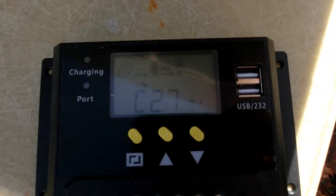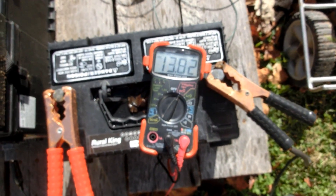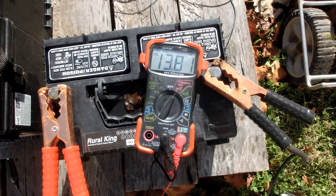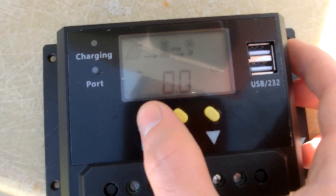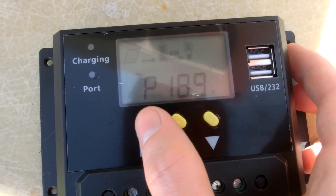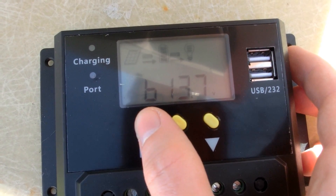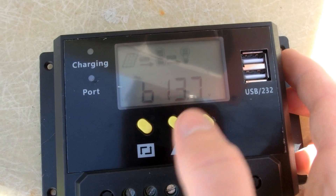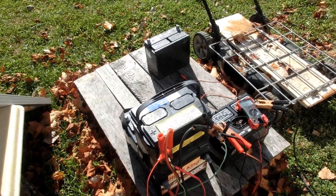This is slightly odd — it's still on the float setting, but it's only giving 2.8 amps. Just a minute ago it was still on the float setting giving almost 5 amps, and it was keeping the battery at 14.2 volts — a little bit higher than I'd wish — but now it's at 13.8. The panel voltage hasn't gone down: battery is at 13.7, panel is at 18.9. Perhaps it's supposed to keep it at this voltage. I'd rather it be at 13.7 than 14.2 — the batteries would produce a lot less hydrogen at 13.7 volts instead of 14.2.